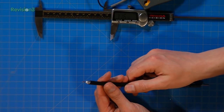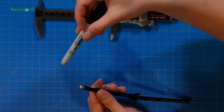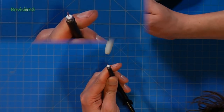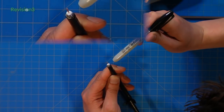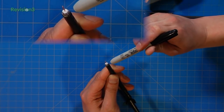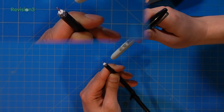Okay. So what you'll actually see here, my multimeter is yelling at me, is we have this bit here, that's our center, right? And that's made out of copper. And then we also have this white piece right there, that's the closed cell foam that we were talking about. That's our dielectric. And then surrounding that, we have a couple of things, but they're all made out of aluminum, whether it's a mesh or just a sheet. This is essentially aluminum foil that is coating this, and that is to prevent interference, it's a shield. However, in our case, we're going to use it to alternate. And so what will happen is we're going to create all these nodes, and the more nodes, we're going to have more gain, and it's going to be really cool.